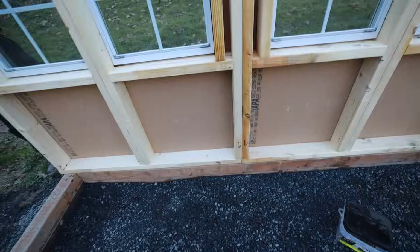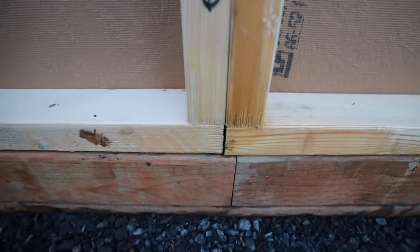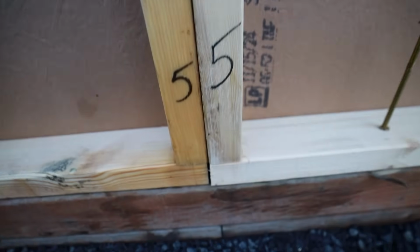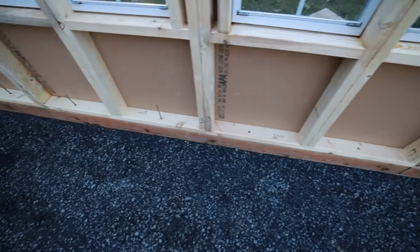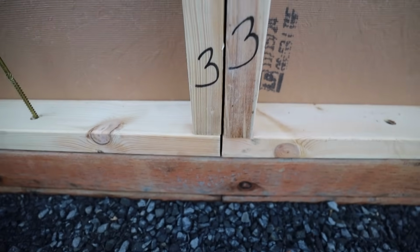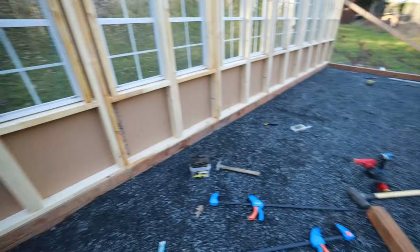And I think I figured out what's going on. I'm able to cinch these pieces of lumber very tight, but as you can see, the bottom plate just has these tiny little gaps. So even though what I'm doing is super tight, that is not tight. This one is probably the biggest one. So the solution I came up with is we're fine up to like here. So I left all of our really long screws in here, backed those out. And as you can see, actually this is wide, kind of all the way across. And all those 1/8 gaps added up. And now we're at a point where I've got to use a hammer to try to fix it.